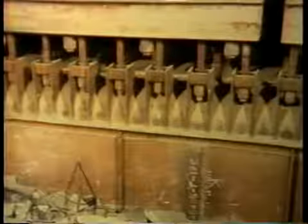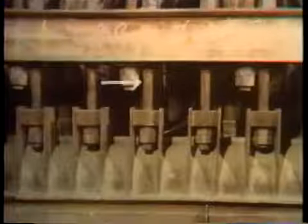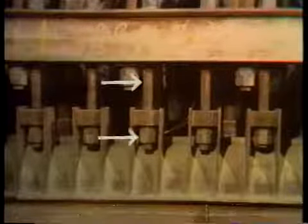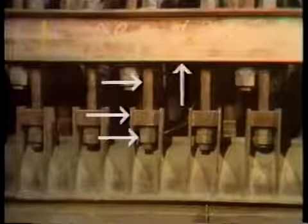The casing is hung at the top, so many of its supports are located there. To determine if there is casing support failure, look for broken or loose hangers, loose attachment bolts or pins, broken attachment lugs, and failure of any of the steel columns or beams from which the boiler is hung.